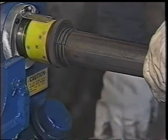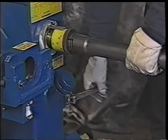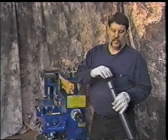Go ahead and we'll bump that up. Again, we rotate that tubing so we don't get any flat spots in there, okay? Expand that up so it's able to fit over itself. One thing I always do again, take the segments back off, put them in the storage tray when you're done with that operation. Say, for instance, you're sizing this, and say with the sight glass at 2, it actually made the expansion too large. There is an adjustment on the machine.